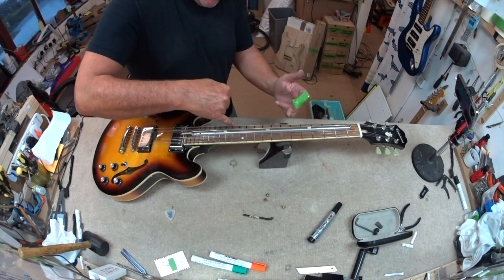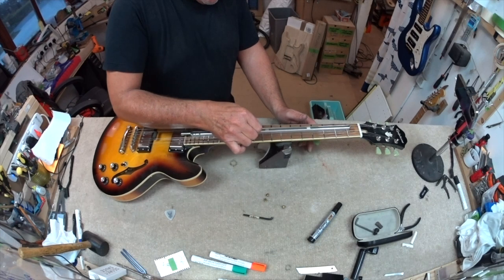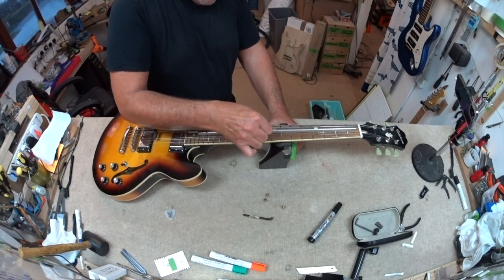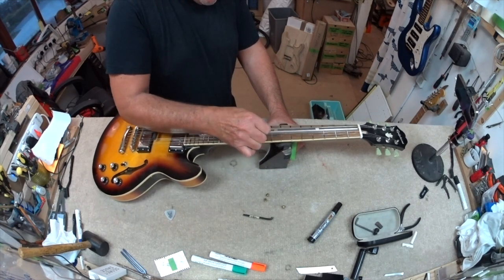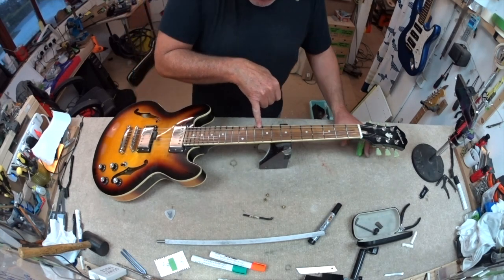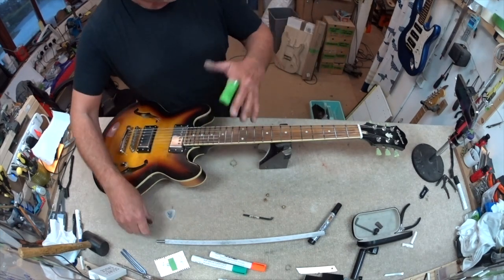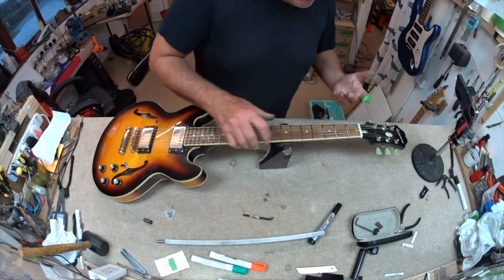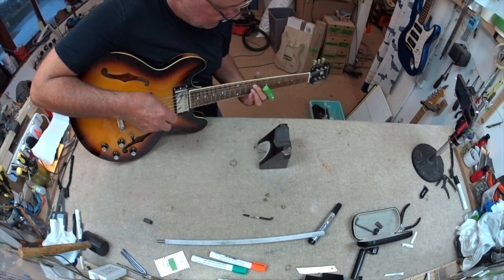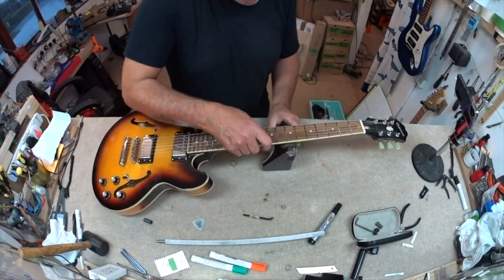So now I'm almost lighter now. What I want is the little bit of fret slap in this section here to go, and I really need the curvature of this rod to do that. So I'm going more side to side and back and forwards. I'm hardly pressing down at all, but I'm letting it just clear out that little bit of fret slap, as I call it. Now, like I say, it's done quite a lot of work on this bit here, but that tells us we've got a distinct hump in this part of the neck. But distinct hump sounds like a camel. It isn't any, you could barely see it, but I know the tool is telling me it's there. That's almost gone. I'm happy with that. That's so little, I wouldn't worry about it.